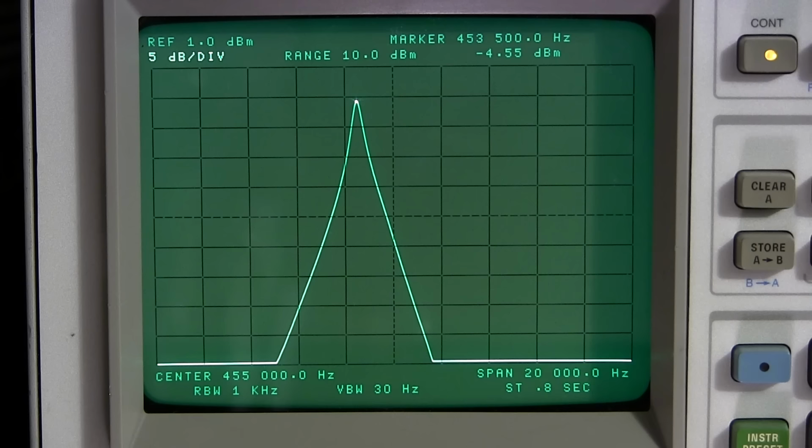This is so close. Again, I don't see any markings from any previous alignment in here. Usually you see little brass shavings coming off the shafts that go into the IF transformers here. So I'm really thinking that this definitely does have the factory alignment in it. So that's really nice to know. The dials are so stiff as well. When I try and move the main tuning dial, it's so incredibly stiff to move. Whereas the receivers that have really high mileage on them almost float around. This is a very tight receiver.